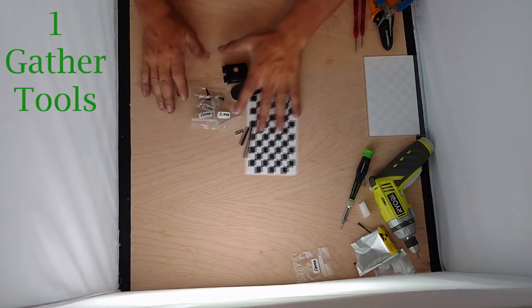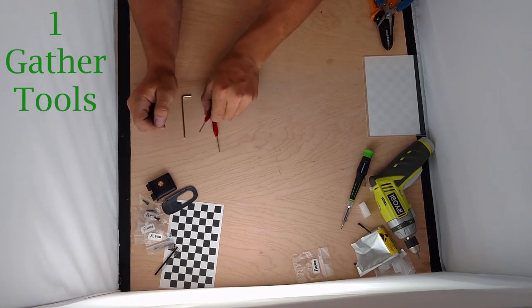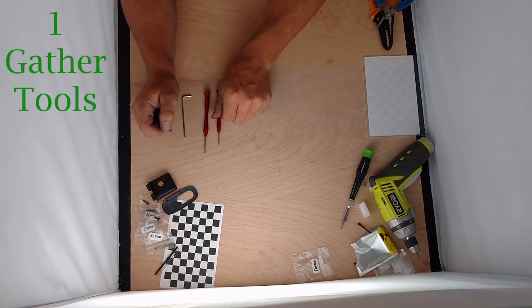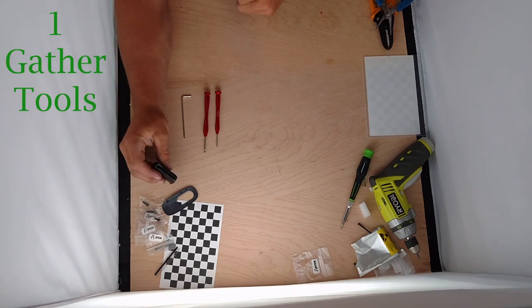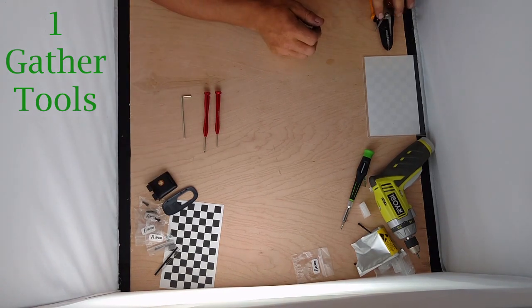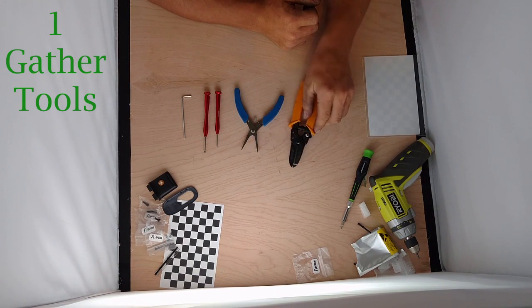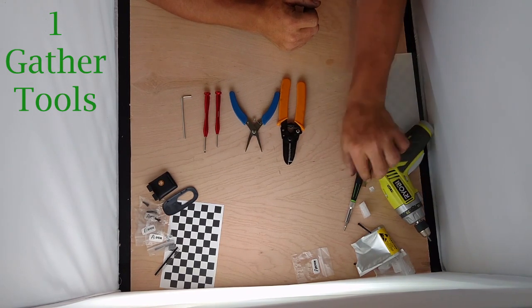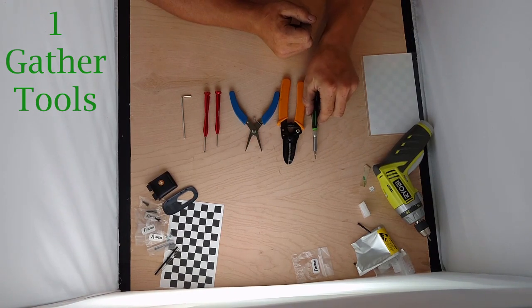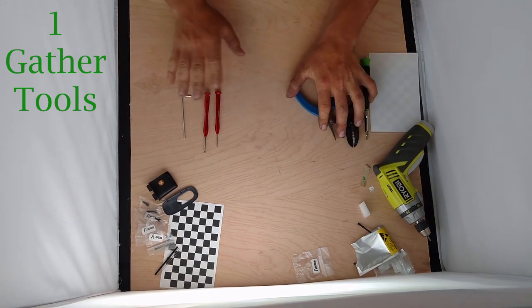The tools I like to have on hand — we include the Allen wrench for you with the ball end, so it gives you some nice angular access. The only tools you have to have are a small flat head screwdriver and a small Phillips head screwdriver to remove the screw from the camera and to tighten the electronics down on the shield. Tools I like to have but are not necessary are needle nose pliers and electrical pliers to help trim down the insulation on the wires. I also enjoy this screwdriver with a 2.5mm hex head — we use a lot of M3s here. But the only things you have to have are those three, and the Allen wrench is included.